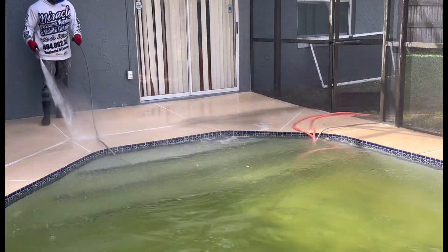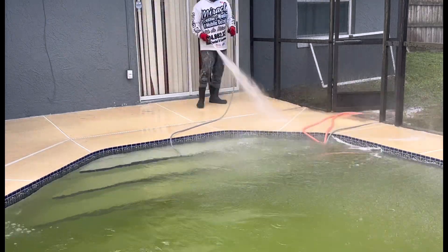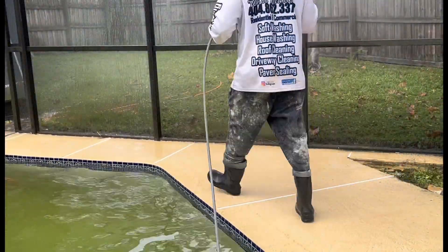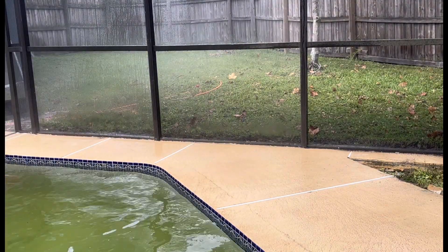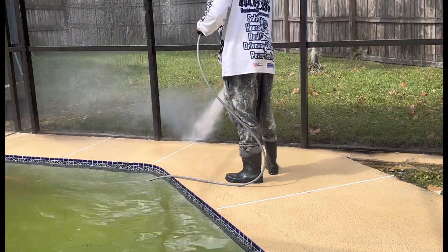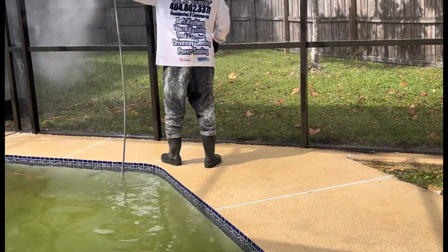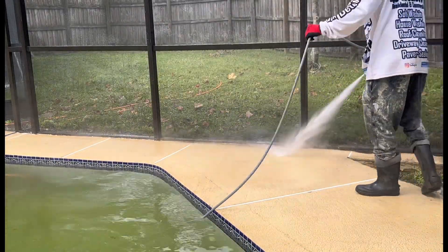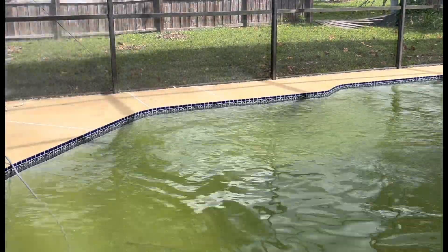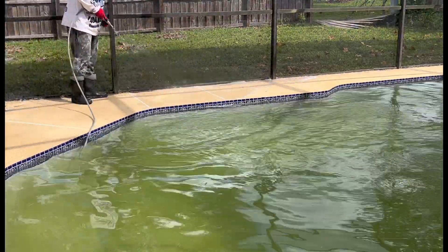Right here I'm rinsing everything off real good. This property came out good — it came out beautiful. When I walked through that door I was like, 'Dang,' this green comes back on you. That's why you have to pre-treat and post-treat this property. I post-treat when I get done — I come back and post-treat when it dries down a little bit. That helps prevent the growth, helps prevent that algae from growing right back. It's not saying it won't grow back, but it slows it down, so it gives you a longer life. It keeps it clean a little bit longer. Pressure washing with just water will clean it up, but a month or two later it's going to be right back green.